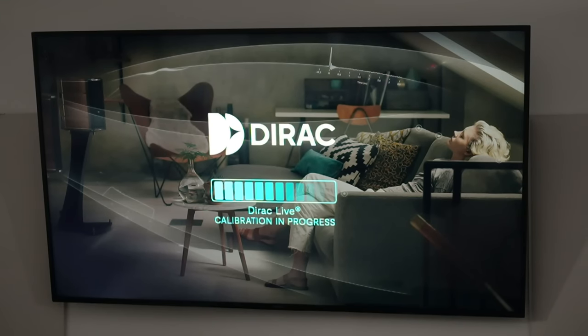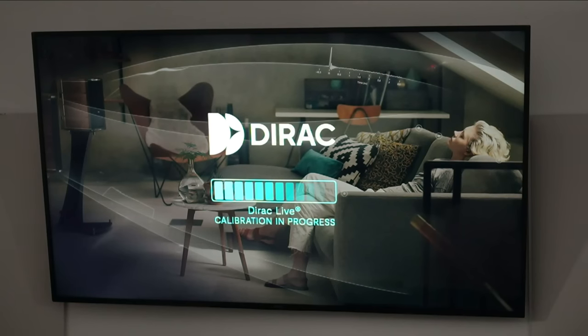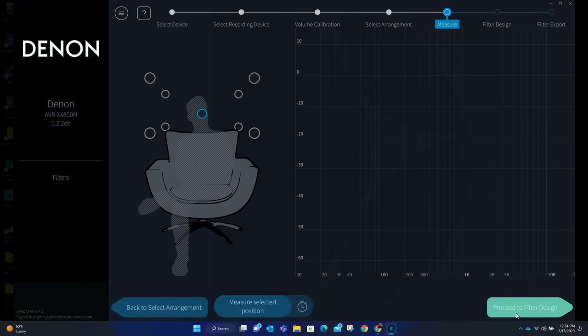Hey Cam, the other thing I want to point out is if we look at the screen here, you'll see that it says calibration in process. While you're making these measurements, the computer is telling the receiver to make a tone, and then that microphone is being measured, and it's feeding that information from the microphone to the receiver. You will get this little indication on your screen that the calibration process has begun. So now when you hit measure selected position, let's go.